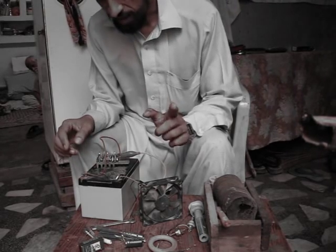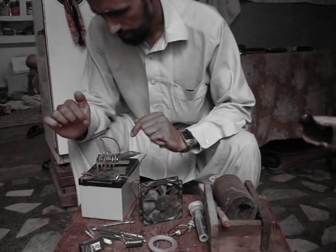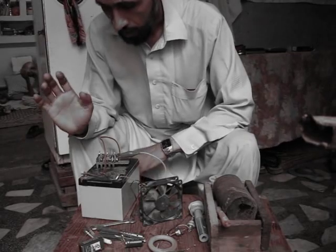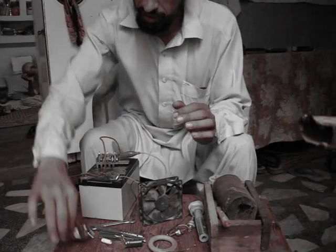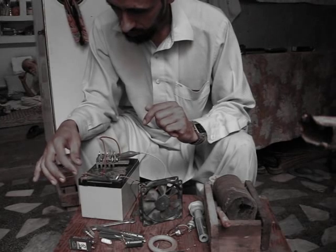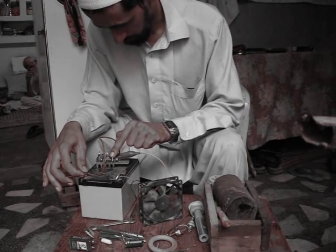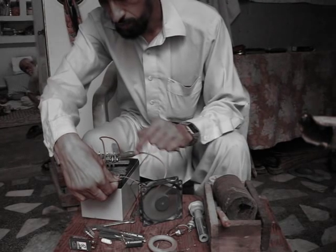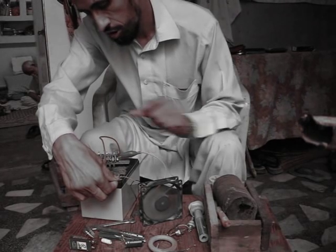Now, simply using my hands, I will demonstrate. The MOSFET I am using is the IRFP150N — it's an N-channel MOSFET. I can also use this 9-volt battery to turn it on, but I will just use the charge of my hand. When I touch the positive pole of the battery and then touch this MOSFET's gate, you see — the fan is turned on! But when I touch the negative pole of this battery and touch the gate, the gate is so sensitive it will turn off the fan.